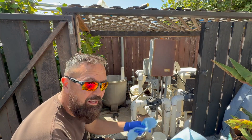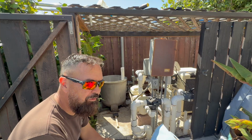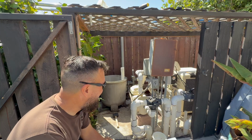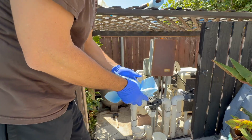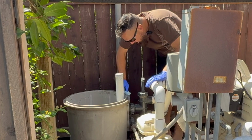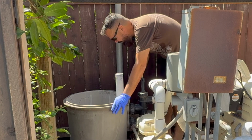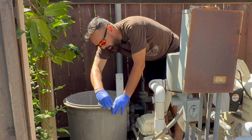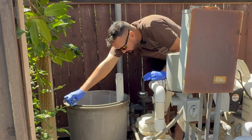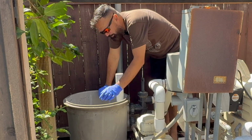All right, now we're gonna make sure we wipe down all the silicone and clean up all of our stuff before we put it together. We want to take care of the ring before we put the filter on, because we don't really want the silicone on the filter elements. The water just won't pass through it. So I just grab some shop towels. I put some gloves on just because I hate having to wash the silicone off my hands. Make sure you get all the water and everything up too, so when we put this back together, we have a good seal. Now I'll probably have to dry that off, because I usually hose this down first, but I didn't today, so I got to hose that down, so I'll have to dry this off again anyway.